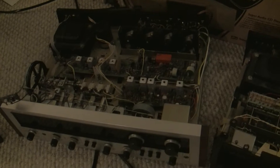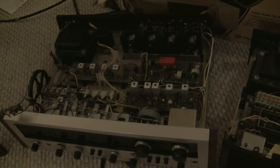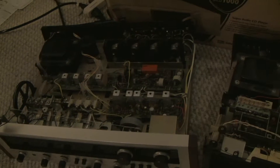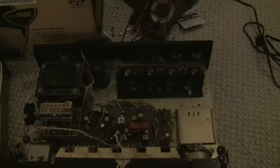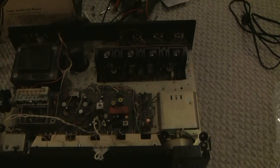We have a SX1500TD — I'll go back into details about what was wrong with it — and we have an SX626 with an IC-based tuner that I have done some work on. It needs to be recapped the rest of the way. You can see the MJ21194 is in the output stage there.